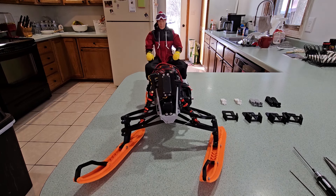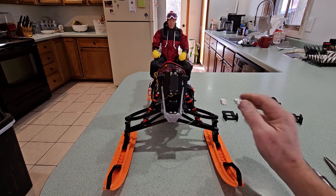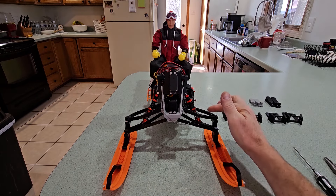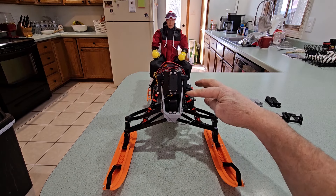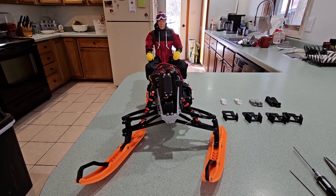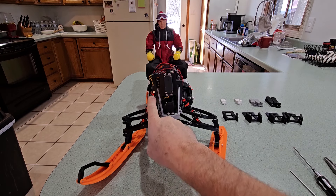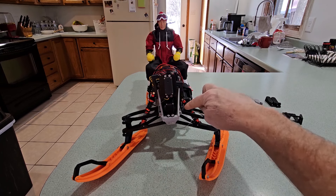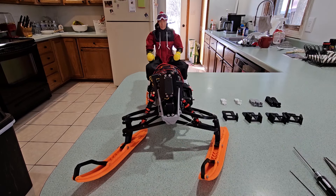Here it is in action. It leans that much, but then this upper suspension arm actually binds against the steering rack and won't go down any farther. When it hits the end of downward travel and I turn to the right, you'll see the shock mount continue to compress the shock. The lean stops and then both sides continue to compress the shock. Even though I would like it to lean more, the pressure comes off of this side so it can fall into the turn. This side has more pressure, keeping it from tipping to the outside of the turn.